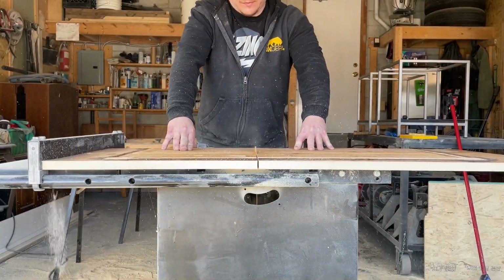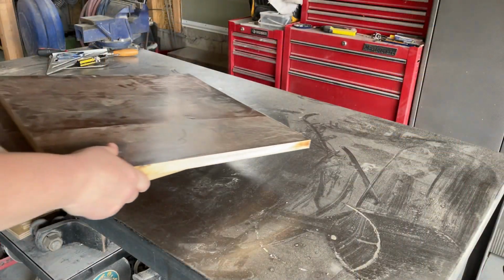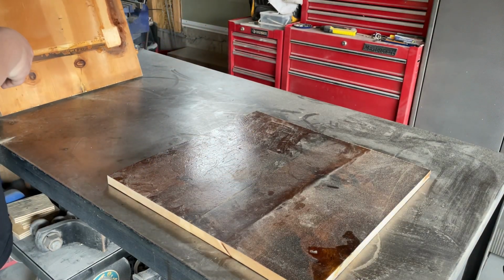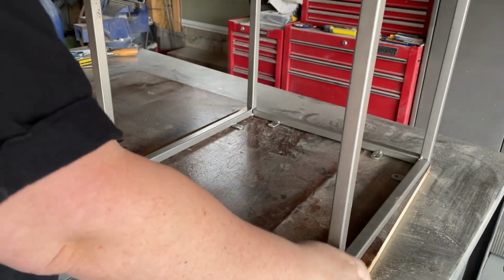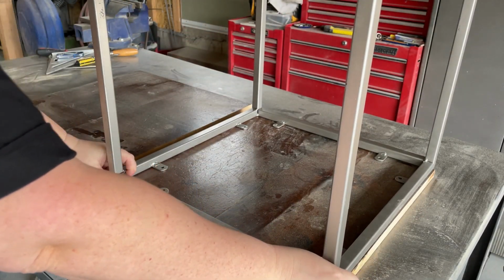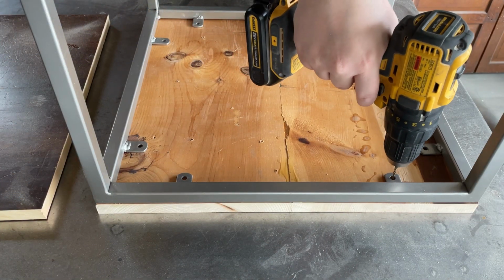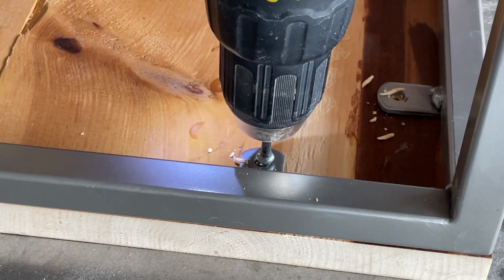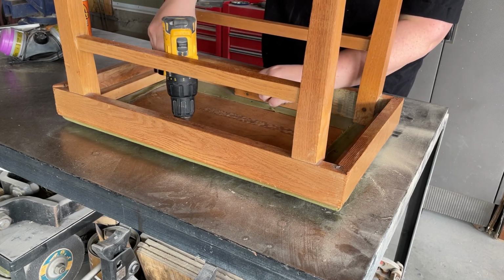Last weekend, I got my husband to cut down another freebie. The top of this old pine table will be an easy and completely free replacement for those topless tables. He just ran this through the table saw to the same measurements as the base, and now I'm using some 3/4-inch screws to attach them from the bottom. This 1-inch board matches perfectly with the bottom shelf on these, and once everything is painted, it will be totally seamless.